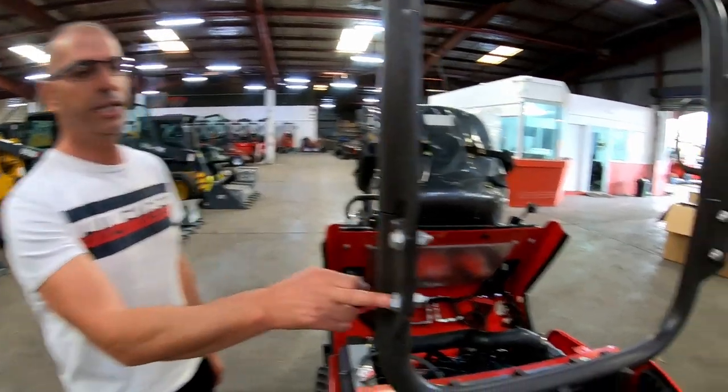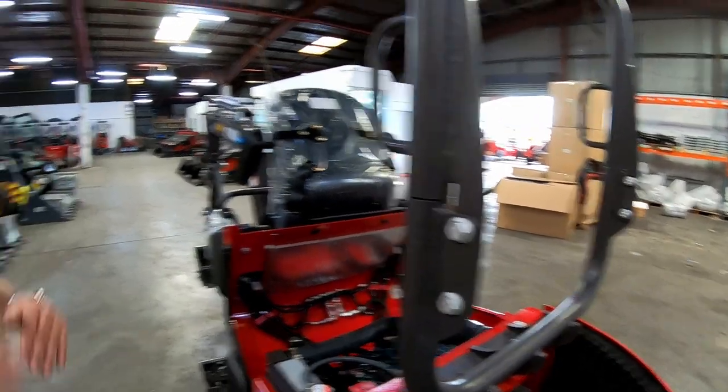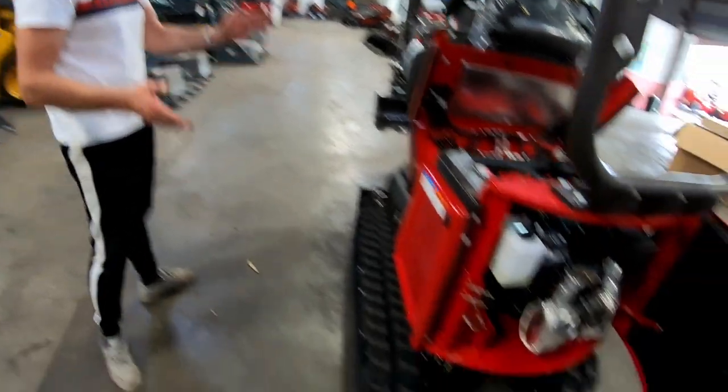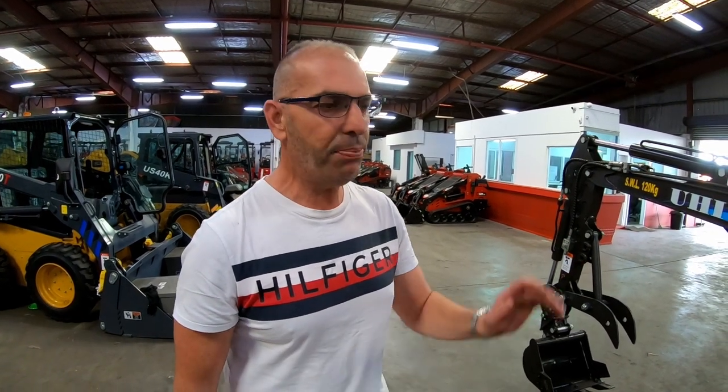You can undo the screws and flip this panel to the back if you're going into a narrow or tight access place where it doesn't clear the roof — so you can go from your garage to the back garden. This model has expandable tracks and the knuckle boom, which is the swing boom. This is what you'd call landscaper and professional-people friendly — this is the machine to go for. Priced at $19,990, that's only $2,000 more than the previous model, and that gives you the 16-horsepower engine and the side controls — there's no extra margin in there.